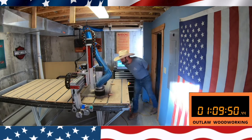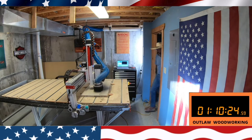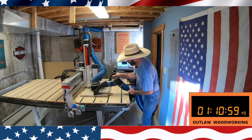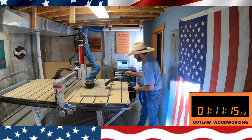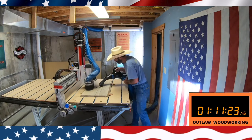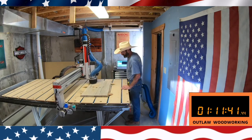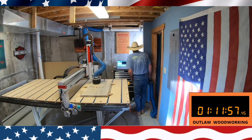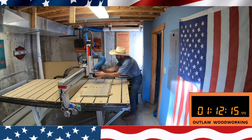There are a lot of little things to think about but all in all it's pretty easy. The only thing I don't like about down-cut bits is they kind of leave material in the slot, whereas an up-cut bit throws it up into the dust collection. But I think down-cut bits do a cleaner job — they don't have any tearout, which is why I decided to use one especially with the 3D image; I don't want any big pieces tearing out. Right there I knew something was wrong because it cut real deep and then wasn't cutting at all — the bit came loose, cut deep, and when it went deep it pushed the bit back up. I hit the emergency stop.